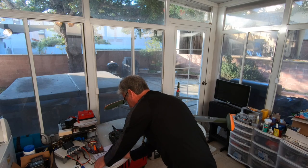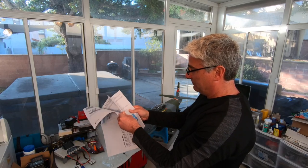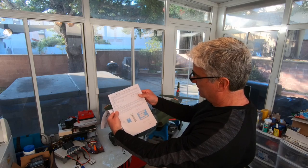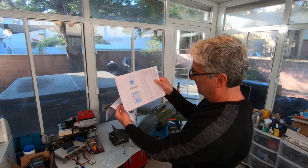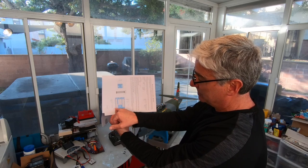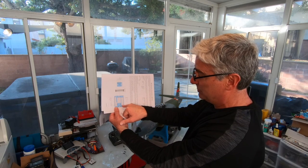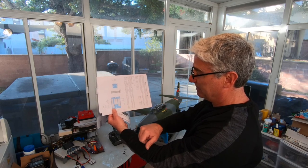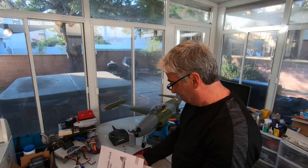When you open up the instructions there's a little addendum having to do with the blue box. If you choose to use the blue box — and I hope you do — you're going to be using page three, which is the MCB-E. Just turn the diagram about 90 degrees and it'll look exactly like it does in the plane. They give you the wires that go into your receiver — everything else is pretty much hooked up. All you had to do was bring in your two elevator servo wires, your rudder, and that was it. Plug those three into your receiver and it works.